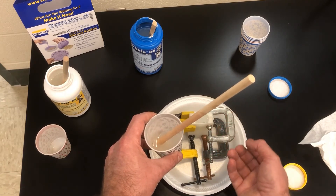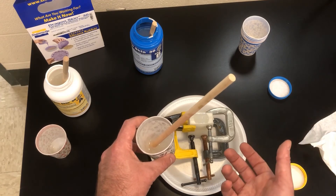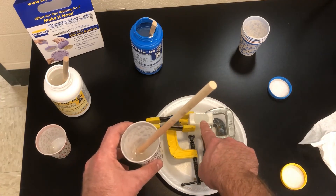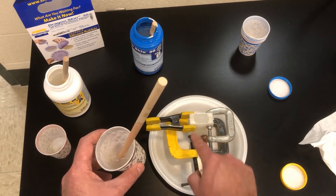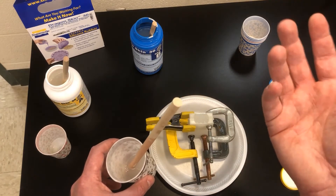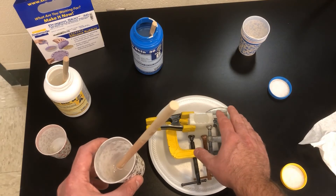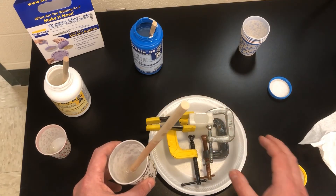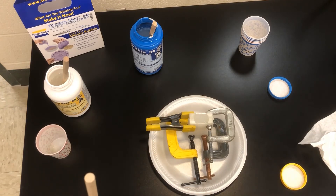It's totally possible that there aren't any air pockets, but I can now see one little air bubble starting to come up. I don't know if it picks up on camera, but there is a little air bubble there — when that air comes up, you should see the level of rubber in the reservoir go down. Dragon Skin 30 has a cure time of 16 hours, so we're going to let this set overnight before we open it up and see what we got.